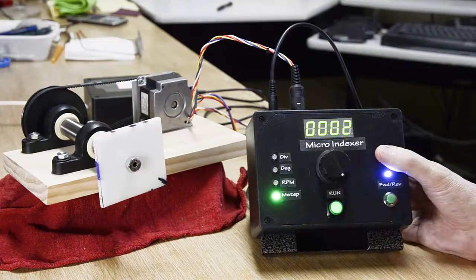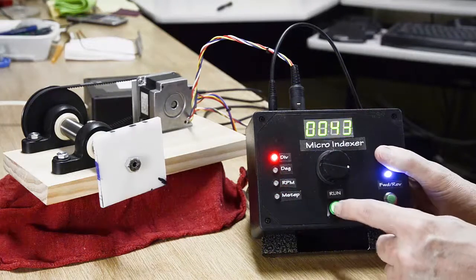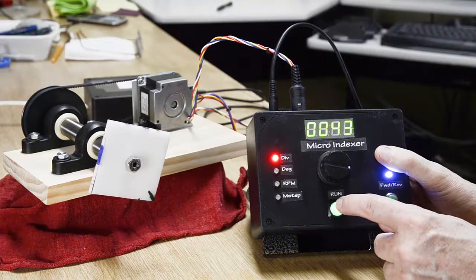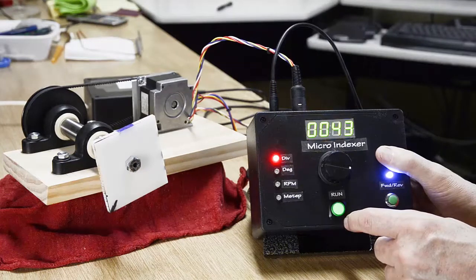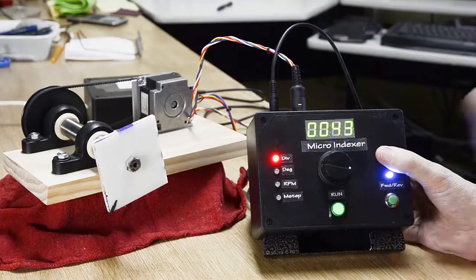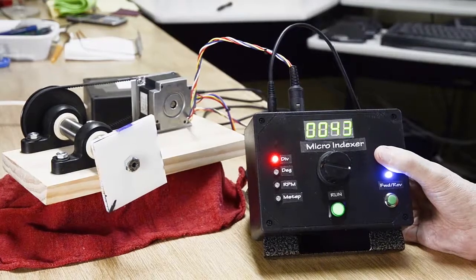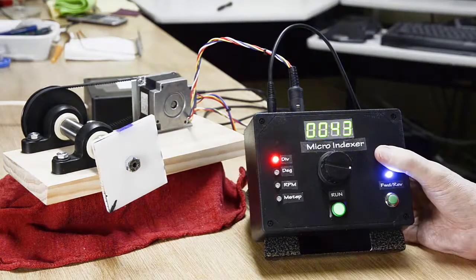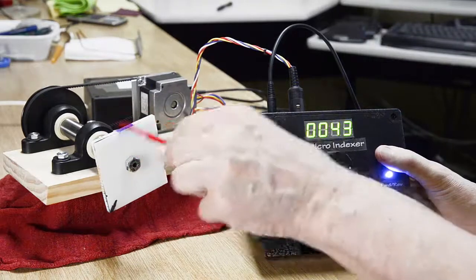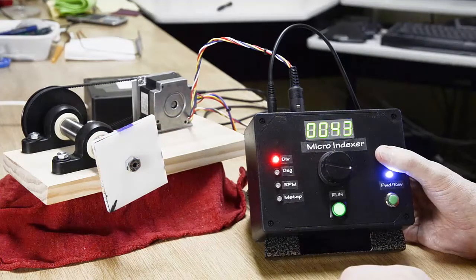Let's go to two, which would be 800 steps. Going back up to our division step again, you can see it's much softer. I believe there's less torque available, but in this application I believe torque isn't so much an issue as is the holding power. I think nearly any size workpiece that would fit within the range of a small mill will be able to be turned and held still enough that the gear cutter or milling cutter will cut across the face. I believe there's adequate holding power here.